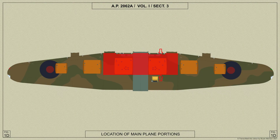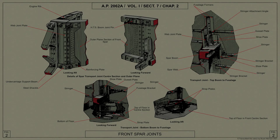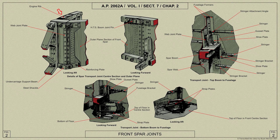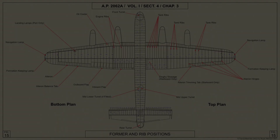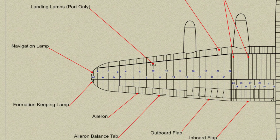The center section spars pass through the fuselage, the booms being left solid at the fuselage transport joints, at the engine ribs, and at the outer plane joint, but milled out for lightening purposes elsewhere along their length. The center and outer planes are interconnected by forged shackles on the spar top and bottom booms secured by bolts which pass right through the booms, and by joint plates bolted to each side of the spar web. From these joints the spar booms are tapered to form an angle section which extends to rib 5 outboard; from rib 5 the spars are built integrally with the wingtip.